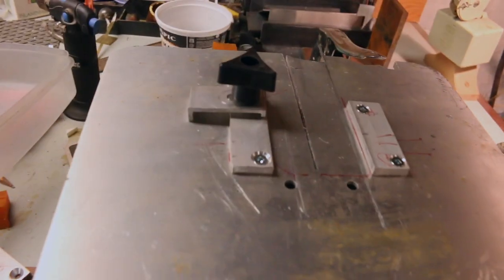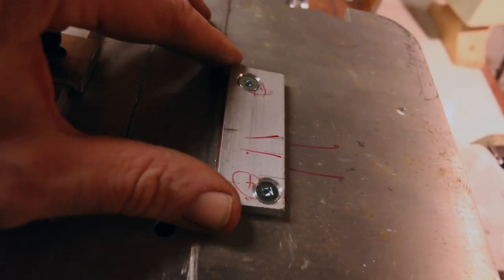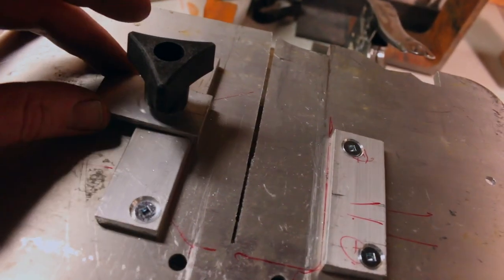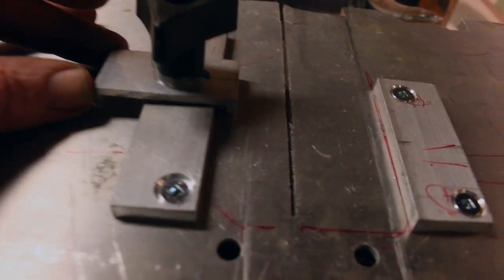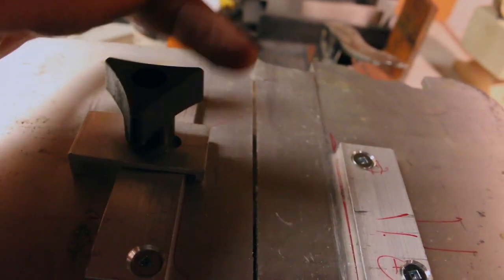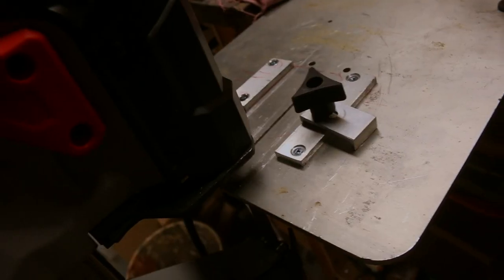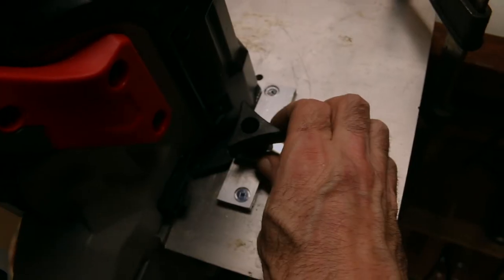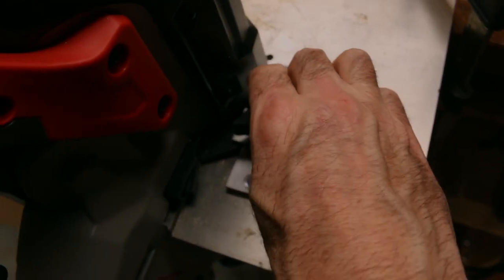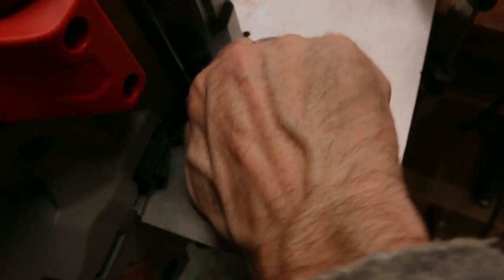Here's my tabletop setup solution — really simple. Just two cleats that slide in alongside the tabletop that's on the bandsaw itself, and then one little dog that slides over and captures it with this thumb screw here. Drop your saw in there — it just slides in. Tighten the dog down and it's held in there firmly.